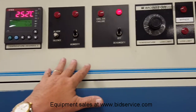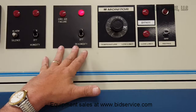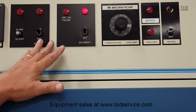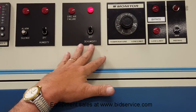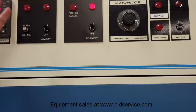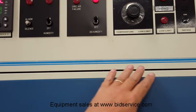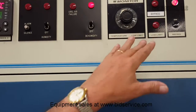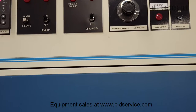There is an alarm silence button, a humidity control on/off switch, and a dehumidify on/off switch. Currently the humidity is set lower than what it is, so as you can see the humidity light has come on — if we had a dry gas hooked up it would be pumping into the chamber. You just heard the refrigeration come on, and as necessary it would cool or heat depending on what your set points are.